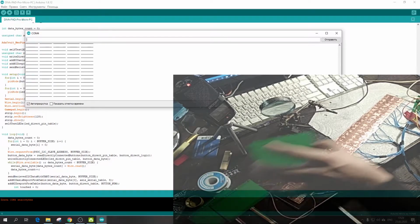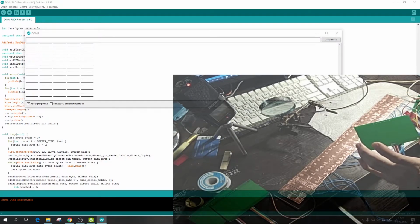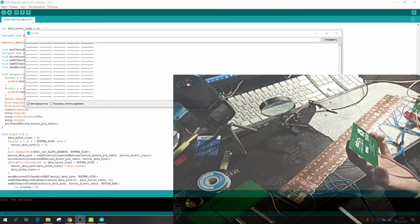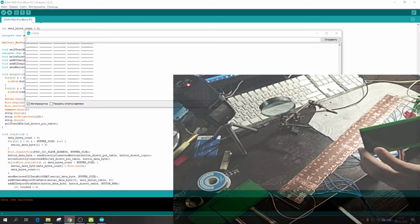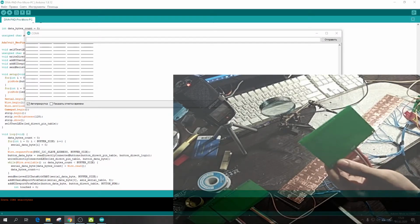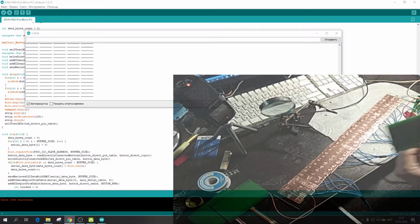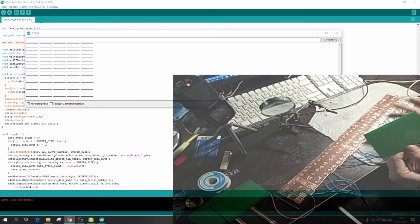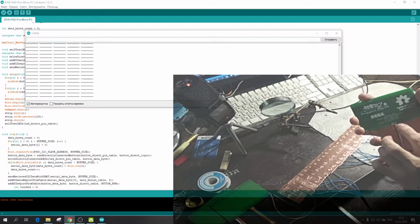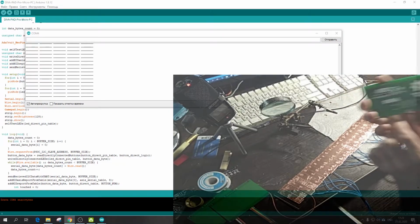It's the first variant of my slider PCB. It has 6 segments, and when we connect 5 of these PCBs, we'll get a slider with 30 segments. But I cannot use this variant because I made some mistakes in it, and the main mistake is the density of the locations for connecting wires. They're very close to each other, and it's very hard to solder.